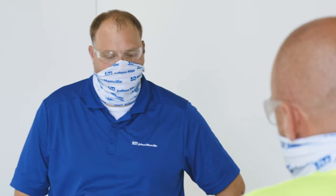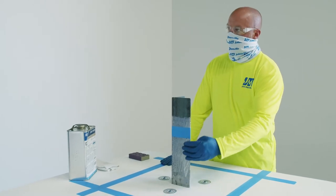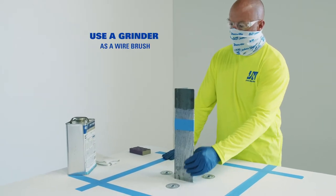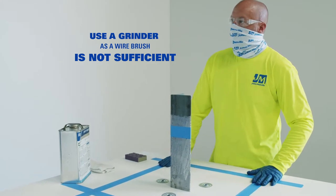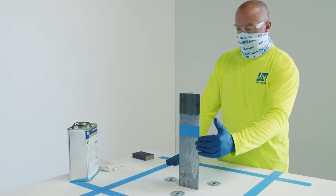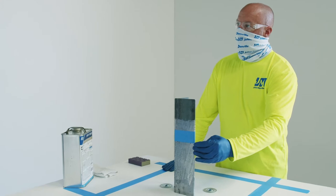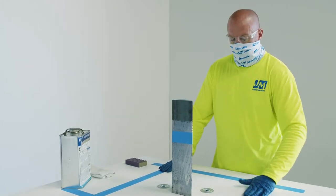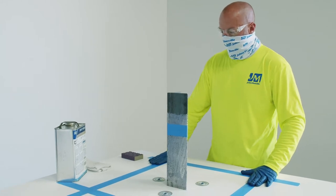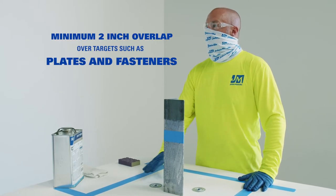The first step is surface preparation. I've taken an angle grinder with a grinding wheel and ground it down to smooth bare metal to make sure we don't have any contaminants, no mill scale, anything like that. You do have to go with the grinding wheel — a wire brush isn't going to be aggressive enough. The flashing height minimum is eight inches per our specifications, so I've come up to about eight and a half to give room for the reinforcement to stop just shy of that so it gets encapsulated. I've taped off a nice even square around the penetration, giving myself plenty of room so that my overlaps from my targets always have at least two inches of overlap.